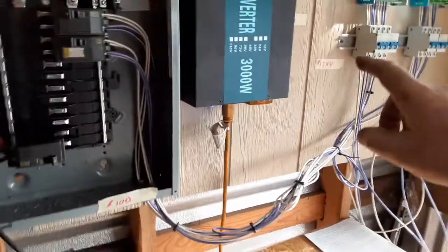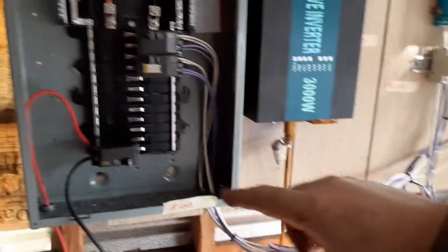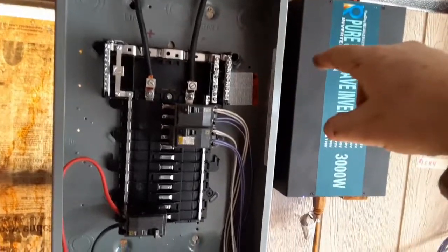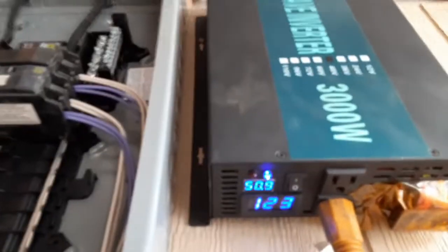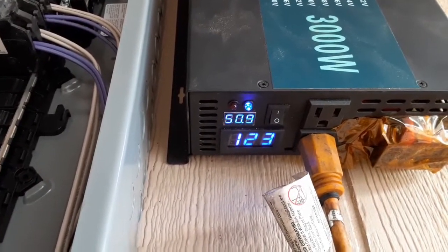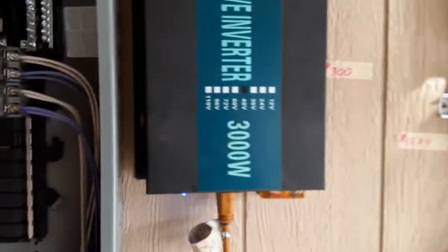Most of the time when it's running, all the power is just coming straight from the charge controllers over to the inverter, just keeping the battery topped off. Right now it's a little low because it's morning, but I'm still at 51 volts and I've been running it for about two hours — it's around 10 a.m. So even with clouds in wintertime, you can definitely run heat and air conditioning off solar.